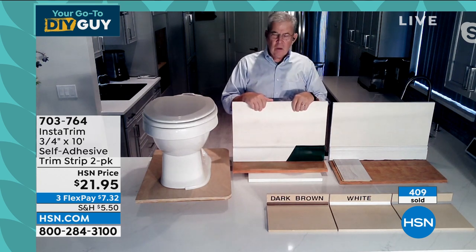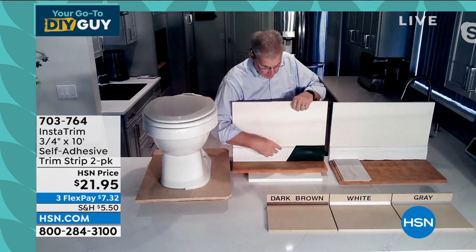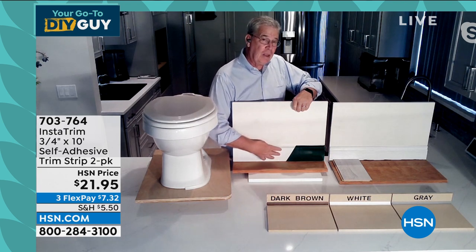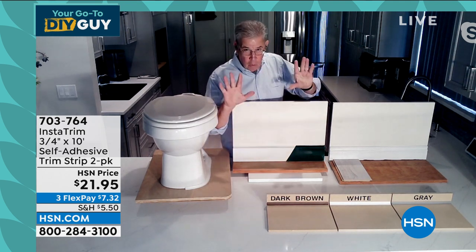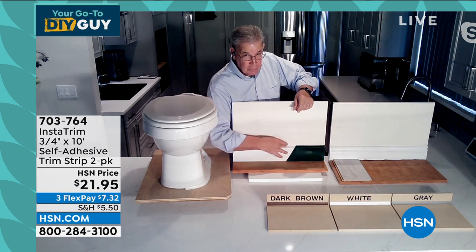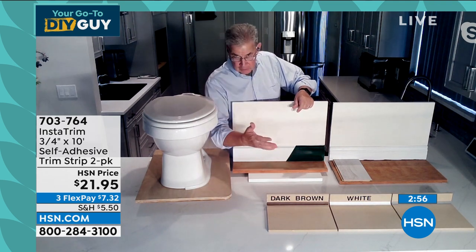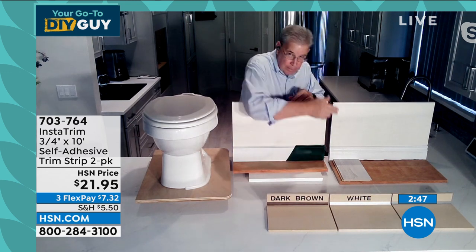After the last show, my wife said, 'You always talk about the fact that you can paint it — why didn't you show them?' So here's one of those new uses. If you bought building materials recently, you know that lumber is so expensive. So instead of buying expensive base molding, I just bought a piece of 1x4, put Instatrim on top of it — no caulk, finished. It's forever going to stay against that wall and that board, and there's no residue on the tabs, so if there's movement, it just rides it.